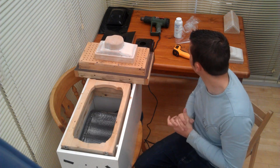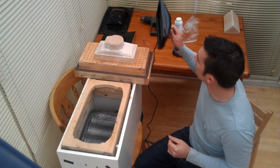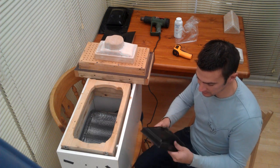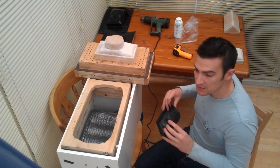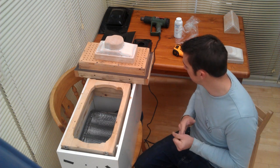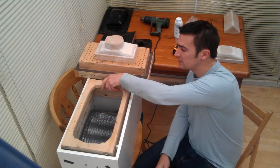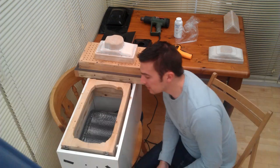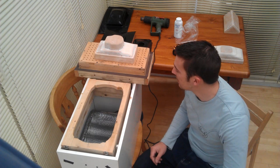This is all a very much improvised setup, but I get quite high quality results from it — the definition is really good and the structure is strong as well. They're not flimsy items. I'm using two millimetre plastic; there's much thicker plastic available up to about six or ten mil, the problem is just heating it thoroughly, which is why I'd probably use an oven for that. It's brilliant to make as long as you've got reasonable joinery skills and some basic electronic skills just to butcher the wiring — it's all pretty straightforward.